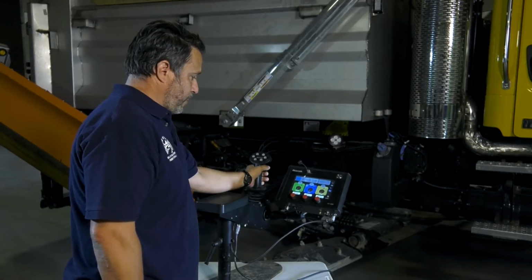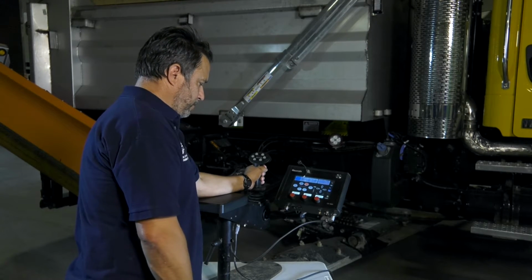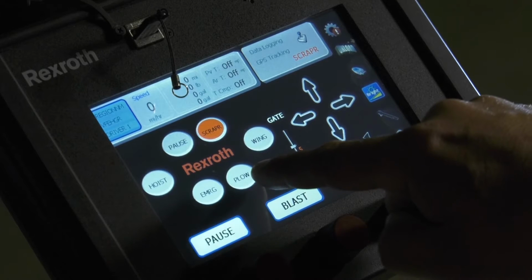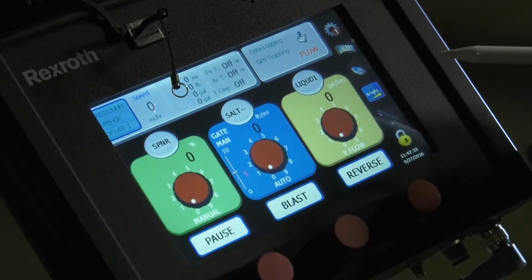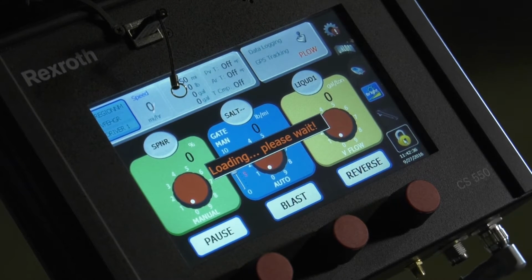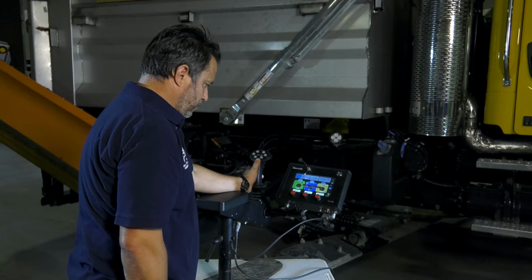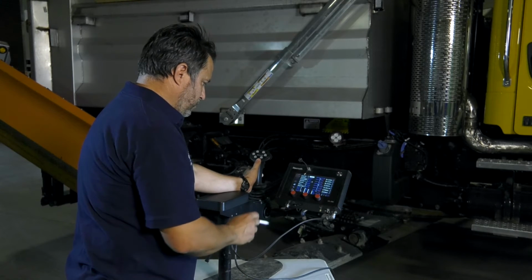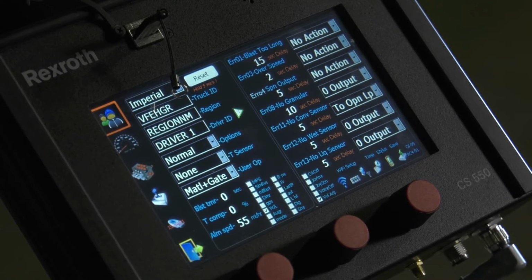Pull your dead man switch in your joystick from the main menu. Scraper. Make sure, in this case it says scraper, underbody, same thing. So we're going to push the lock button to go to the next function screen. Once it loads up, this is going to be a little more efficient way to calibrate your joystick. We're going to do it manually one way and put numbers in the other direction.